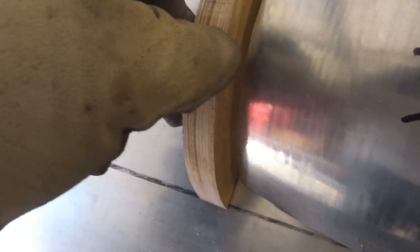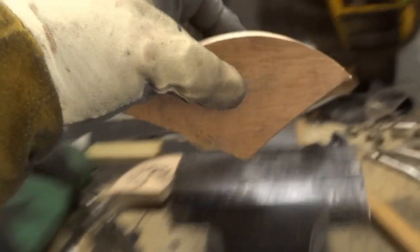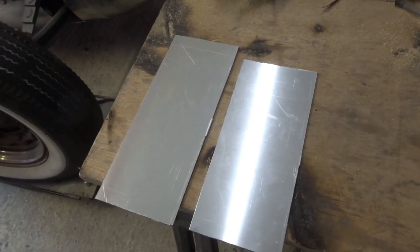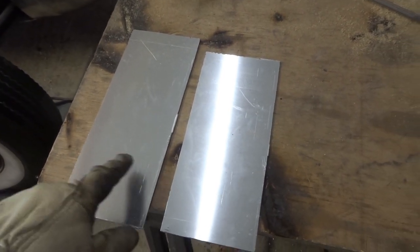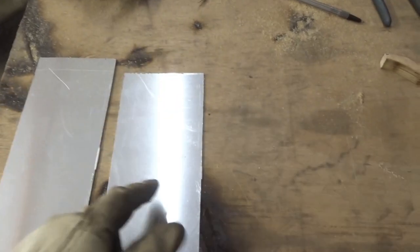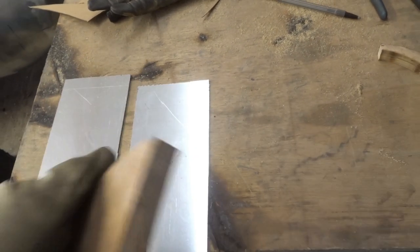The main thing is to get the right curve. So we'll put that in the vise, and then with the English wheel start working on these two panels. The panels are slightly longer than they need to be and they're 10 centimeters wide — that's the main thing. I'm just going to wheel them until they bow and curve like that and also curve that way a bit, and get the front edge to fit that curvature.